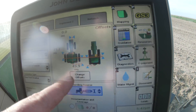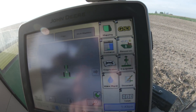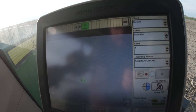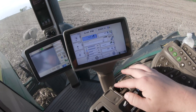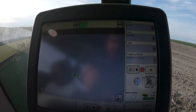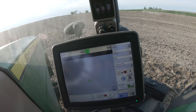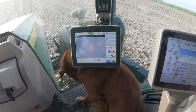It's set for SCV1, so when I set the implement down it will automatically start recording. We're already set up to go. This first pass is pretty important — it's going to be the one that sets my line and I'll be able to follow it after this. I'm going to go ahead and set the vertical tillage down while pressing SCV1 down to detent. The flashing light indicates that the Green Star 3 monitor is recording, and as I drive forward there will be blue coverage shown.